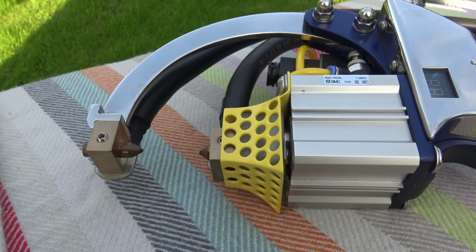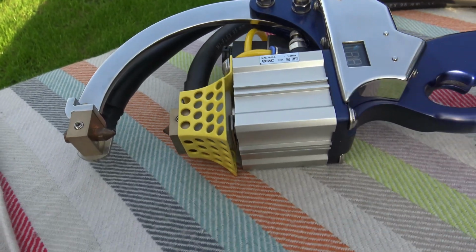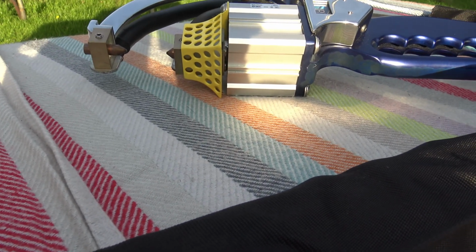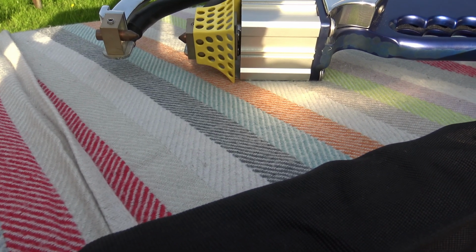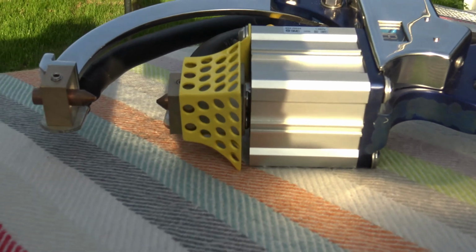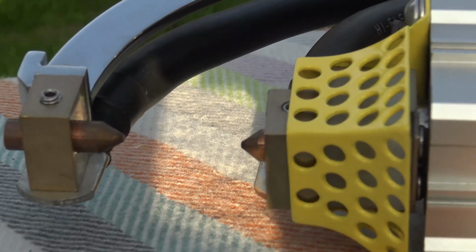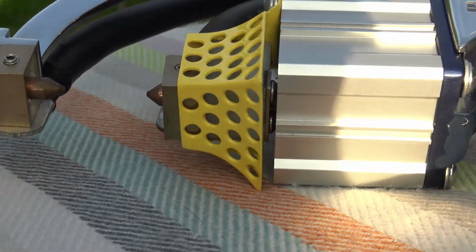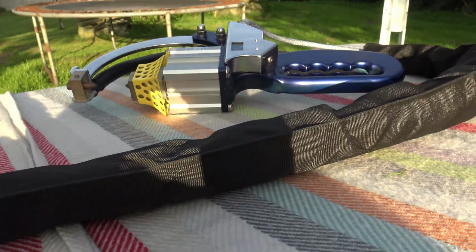So if there's two balls coming down parallel to each other, two rods, a radius on the end, there's a chance that they'll always be hitting on that radius, but with points, the points can be off. So that's a problem here. So I'm gonna take these back to balls, to round radiuses. If that makes sense, I think it does. Makes sense to me anyway.